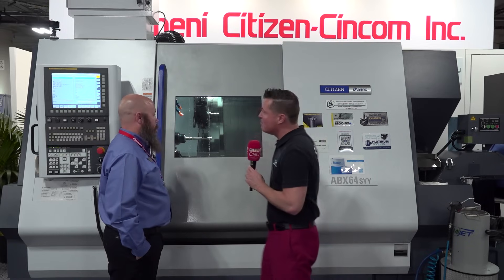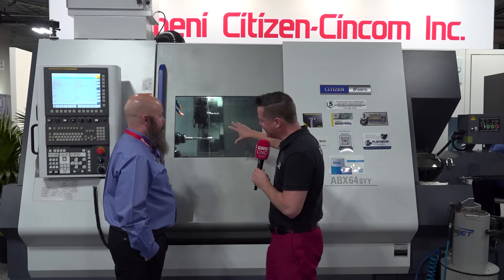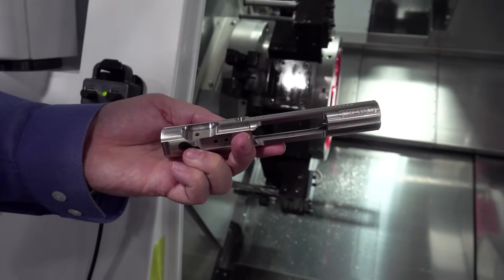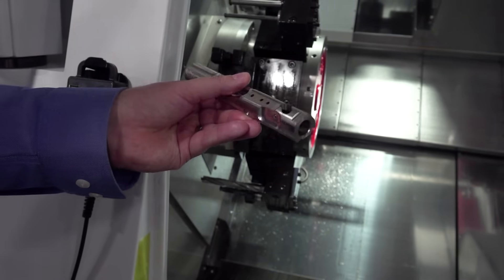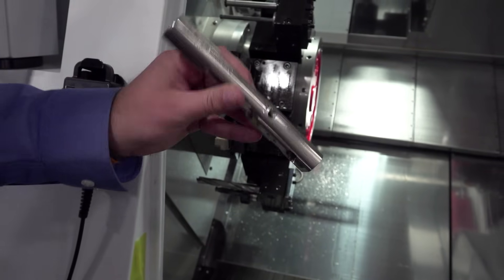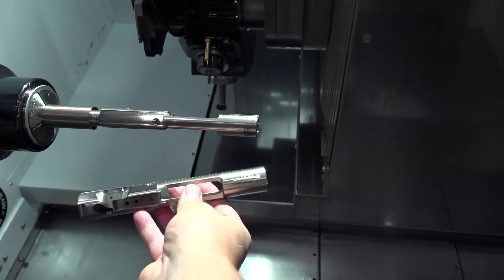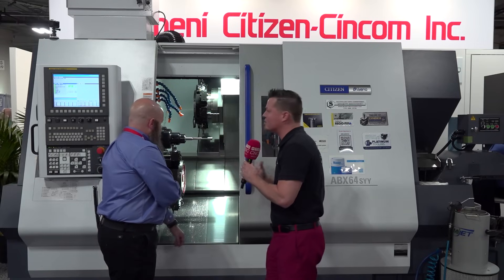We've been talking about this machine's rigidity, flexibility, overall capabilities, ease of use, and multitasking — but we're at SHOT Show, so we have to let the audience know what we're actually making. Right now we're actually making an AR bolt carrier, tested with 8620 steel feeds and speeds, and we're making it sub 7 minutes. It comes off complete, and the amount of tool positions you have, you can just knock it out simultaneously. We're talking things like pinch turning that create that unique type of machining. Would you like to throw out some numbers on speeds and feeds?